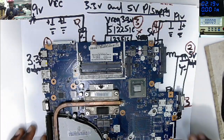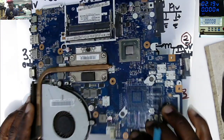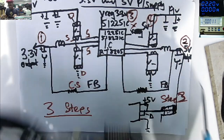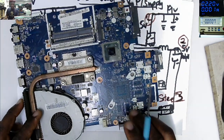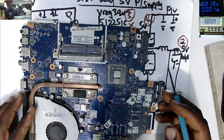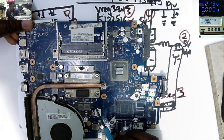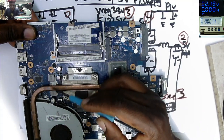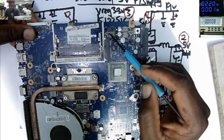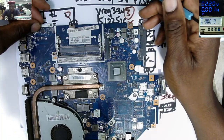What we just learned. This is an Acer motherboard with the charging port, and our first input MOSFETs, they are here. After the two MOSFETs, the current sensor is on the other side here, our black thing. So here we have two power supplies, that's for the processor, and we have some coils here. This power supply is close to the RAM socket, so probably this power supply is for the RAM voltage, 1.5 volts power supply.